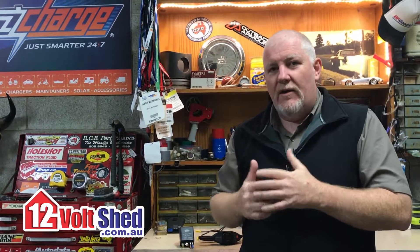There's a lot of conjecture in the industry. I'm sure if you lined up 10 experts and asked them all what is a safe low voltage disconnect, you may get three or four different answers out of those 10 people. But I always say look in the user manual for the battery, because that will be the actual source of the information you need — not supposedly experts like me. Always download the user manual with your battery and have a look at that point they say is a safe low point.